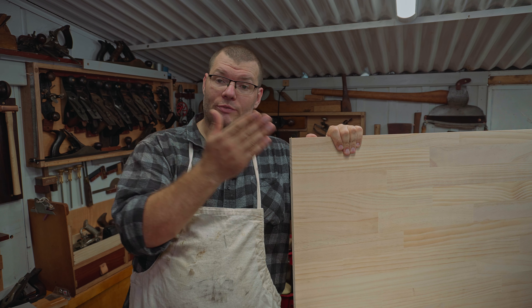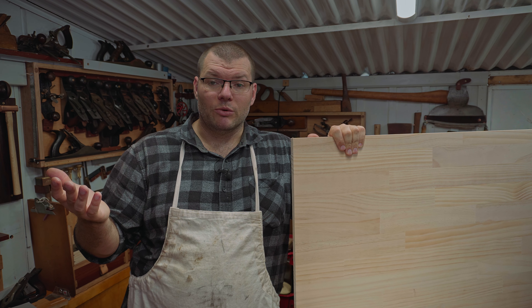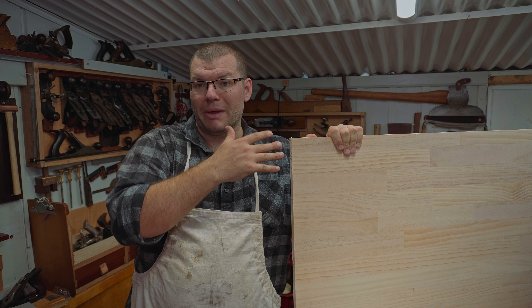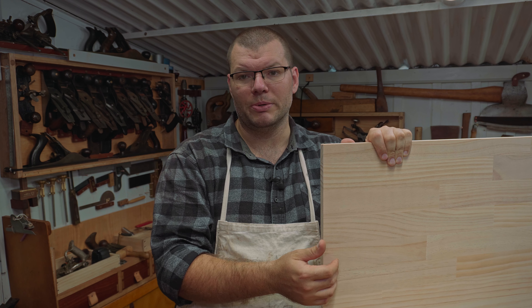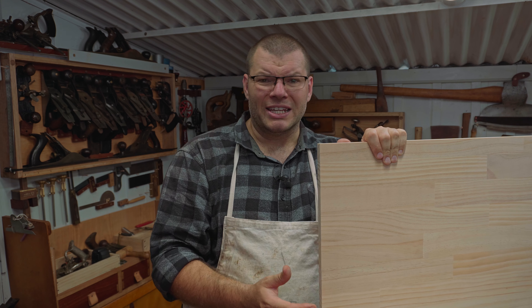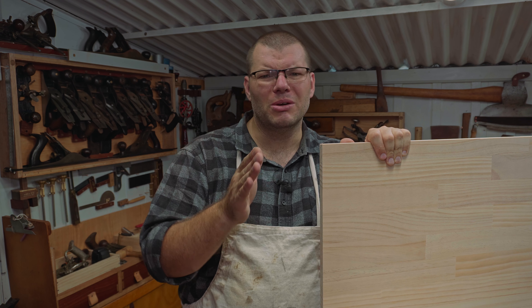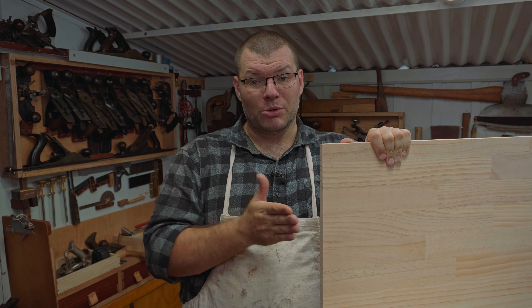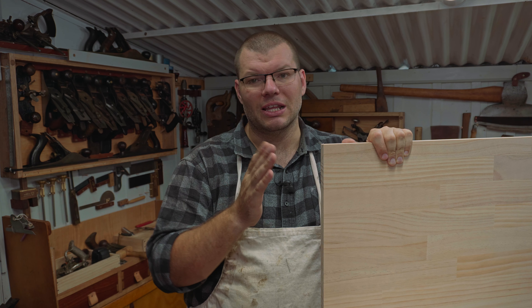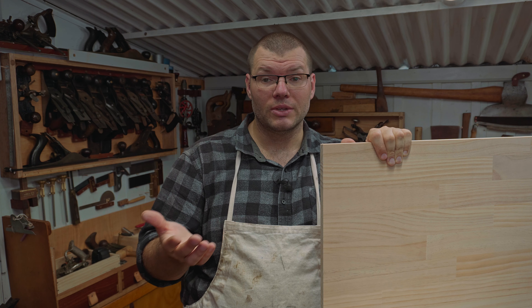The main reason I wanted to show you how I got my design was so that you guys can customize it for your vehicle — to get the size of your top plate you really just have to customize it for the vehicle you're working with and exactly where you're putting that platform. The same design could work in the back seats of your car as well but you'll have to modify it yourself. I'm just going to use a screw design on the top here — just rebated screws to hold it in. I'm not going to glue it because I want there to be a little bit of movement; going over corrugations you might want a little flex. Screws give a tiny bit of movement, more strength than nails, and you'll still get some flex in the wood if it's not glued.